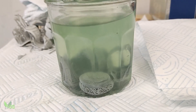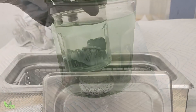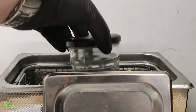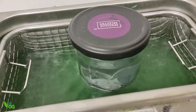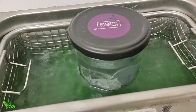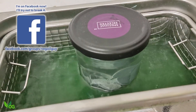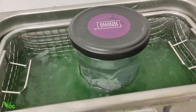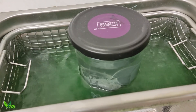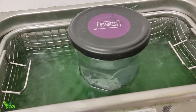One: place your prints in a container with ethanol, agitating now and then for 10 minutes until you see a colour change. Two: still using ethanol, use an ultrasonic cleaner for 5 minutes. To reduce the amount of alcohol I needed, I kept my prints in a small container and filled the ultrasonic with ordinary water — as long as you don't mix the two, this works very well. In either cleaning case, the prints change from green to grey and now need air drying for completion.